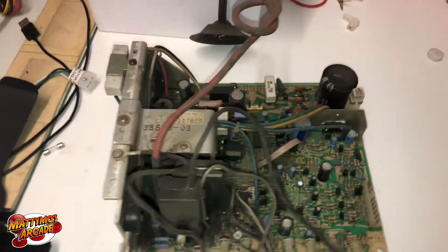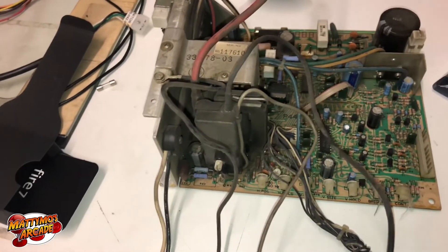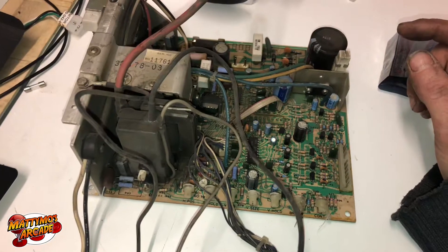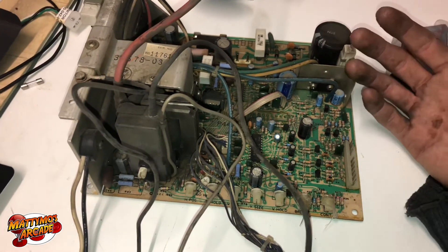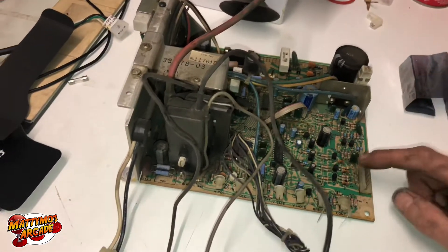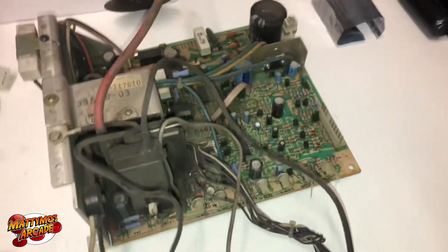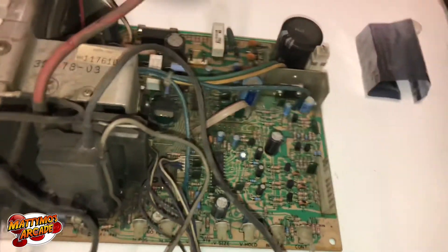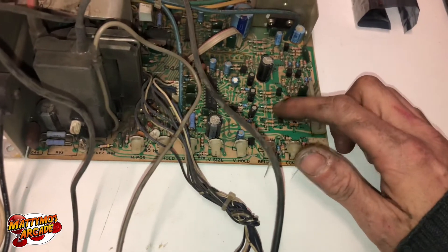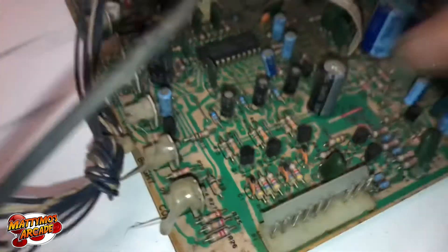Sorry about the fan, but now I can talk without worrying about copyrighted music. So this is the one we were looking at through the montage. It looks like the red is black, and where the black should be is red — they're flip-flopped. I've seen this several times on this K7000, and it usually traces back to this transistor. Usually we check the transistors on the neckboard, but if the colors are flip-flopped with black, it's this guy here. The part number is 2N3904.